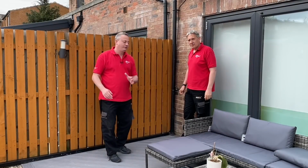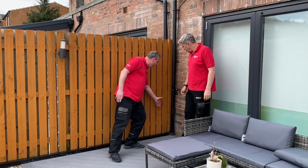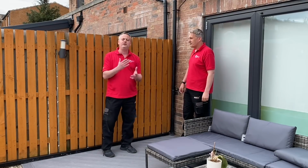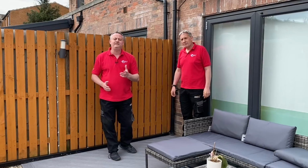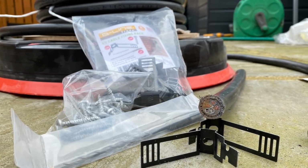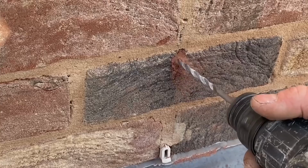We've taken our EV Ultra cable out of the end of our 50 by 50mm trunking. We've brought it up the left-hand side onto this flat roof, and we've secured it using our D-line safe D clips we've seen on the channel before. Yeah, we have. We reviewed them, and they even come in a handy pack for EV installers. It includes a drill bit.